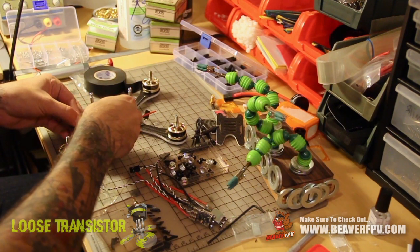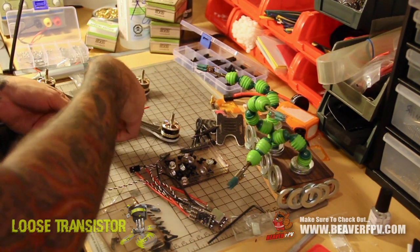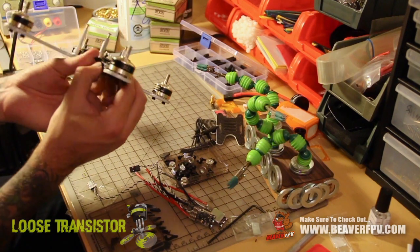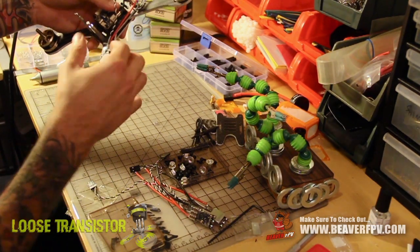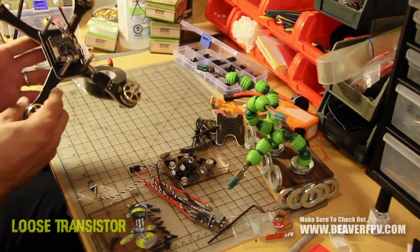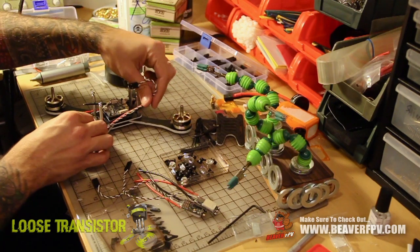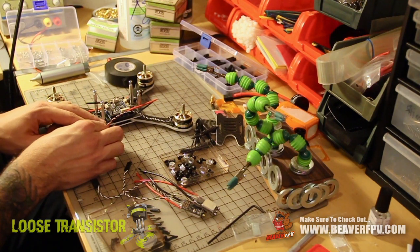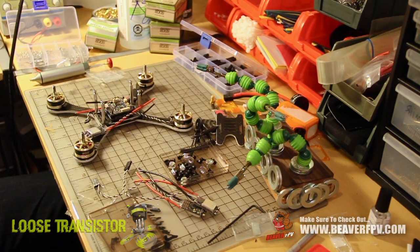The conformal coating is heat resistant enough to be hit with the heat gun when you do something like shrink tubing, but it will melt or burn away when you hit it with a soldering iron — which is nice, since it still gives you a very clean solder over any space. Now we're going to start laying out the ESCs. I like to use just electrical tape first, and then later come back and put actual zip ties.